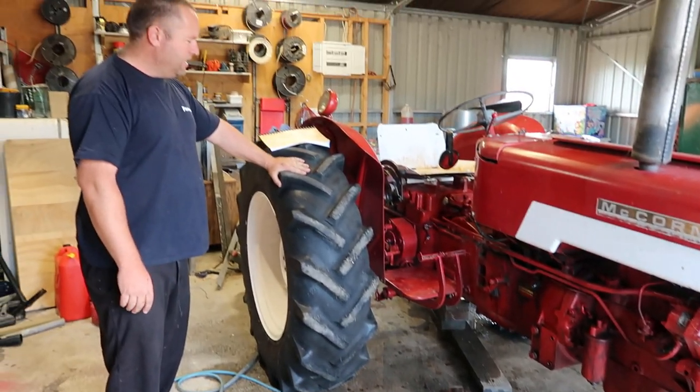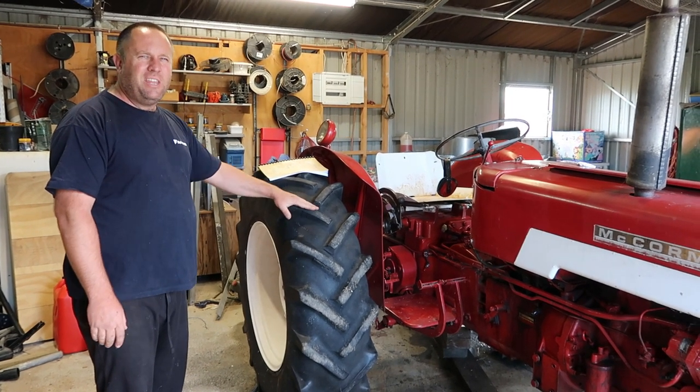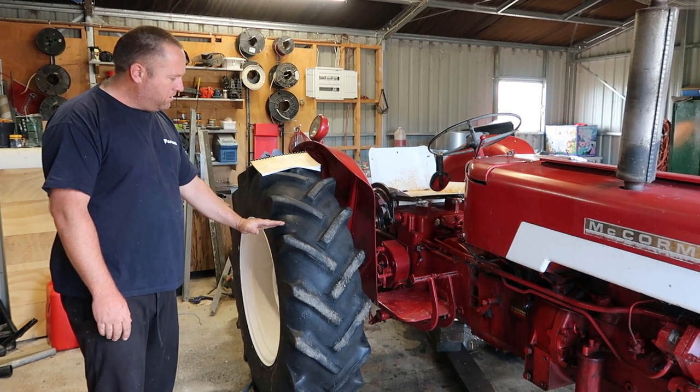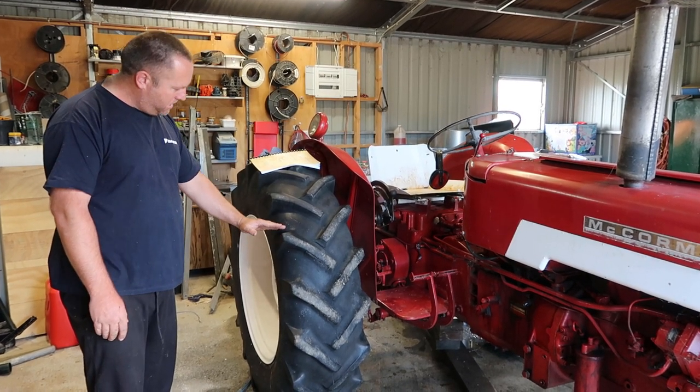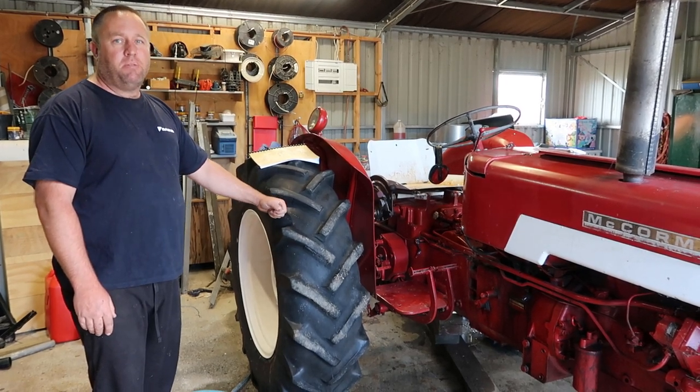The front ones I've been told between 12 to 20 PSI — about 15 pounds. So I'm going to fill them 70 to 80% full of water and then put a pressure of about 15 PSI in them.